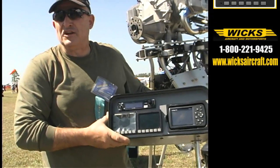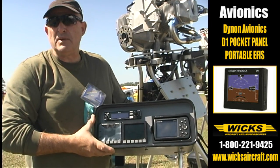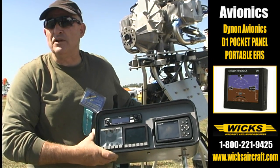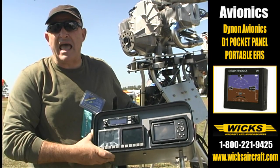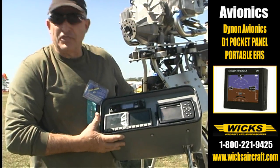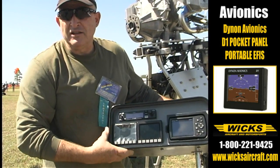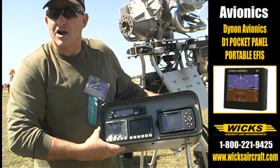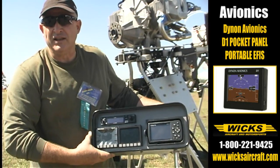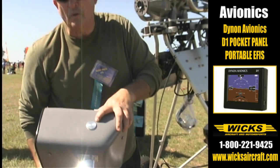One of the things I like to do is tinker a bit, going between the very simple and the complex. People think these airplanes are too simple to be the kind of planes you want to fly now. So I've taken a mixed bag of high-lift devices, a more complicated and more powerful engine, and the third part of this triad — I've tried to build the smallest glass cockpit available. It's got two displays built into it, an engine management system with all your aviation data, a Garmin 296 built into a gizmo, and a full ICOM panel-mount radio. It even has an angle of attack indicator built into the probe, using a Cessna static port.